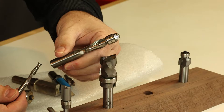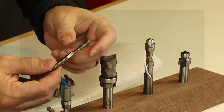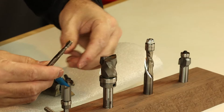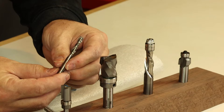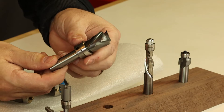This combination of these three bits is really a help to me in the wood shop and I would start any basic router collection with these bits. If you're not ready to spend on a solid carbide large diameter bit — they're a little expensive if they're half inch diameter or larger — you can just jump into the game with a quarter inch spiral bit. This is still 100% solid carbide, but because there's less material involved it'll be a lot more affordable. This is a great plunging bit. Comparing the plunging action of something like this versus a straight bit, there's no contest — you definitely want to use the bit geometry of a spiral. It makes it really easy to plunge and the router won't fight you.